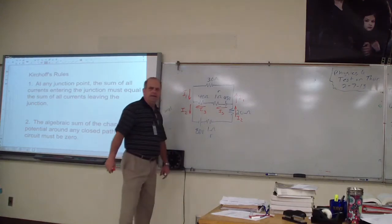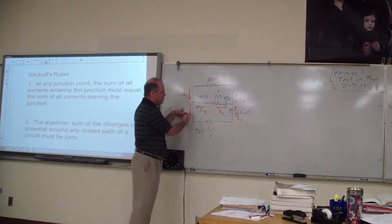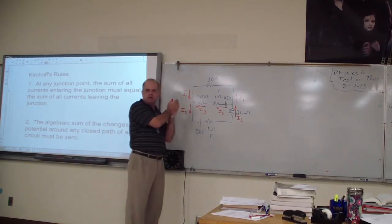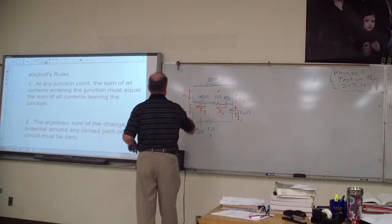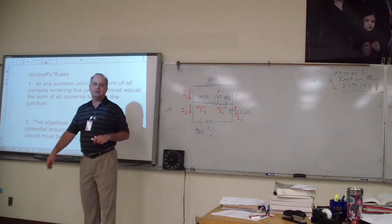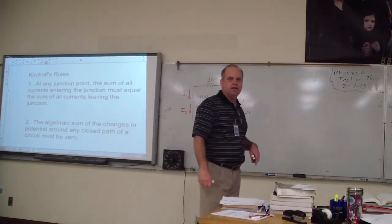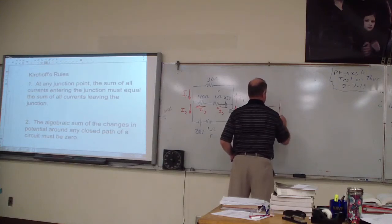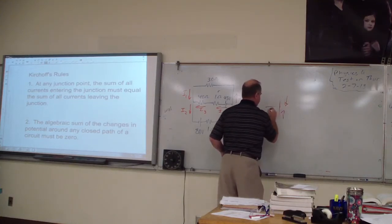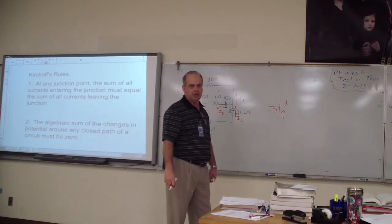Now, the one thing you have to watch out for: you can't have currents all going in or all going out at a junction, can you? It doesn't make sense. Is everybody clear? Now I'm going to solve for I1, I2, and I3 using these rules. Mr. Brent, what do you mean, it all has to go in and out? What if I did this at a junction? Here's a junction, okay? If I did this, is that possible? No. One has to be coming in, two have to be coming out, right?